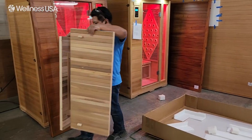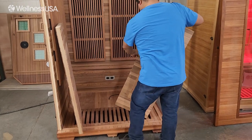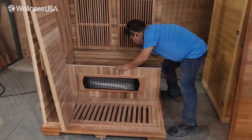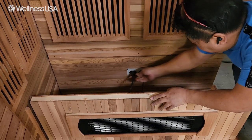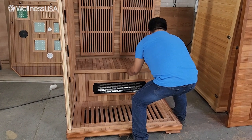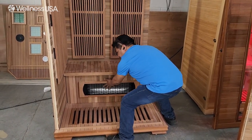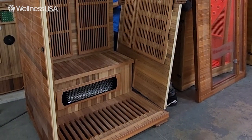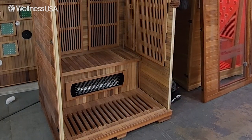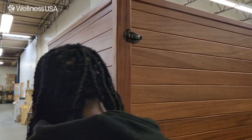Next, you will want to install the seating bench. The first piece to install is the piece with the heating element. Position the piece horizontally with the heater vents towards the open end of the sauna. Fit the bench piece into the molding grooves on the left wall and plug the power cord into the back wall outlet, and do the same with the cord on the sauna's base. Next, place the top of the bench against the left and back walls, resting it on top of the back's horizontal ridge and the bench piece with the heating element. Next, install the right side wall, ensuring that the vertical ridge on the bottom is underneath the seat of the bench. Secure it in place with the corner latches. Once that's been completed, your bench should be fully secured and you won't need any additional hardware to support the bench.